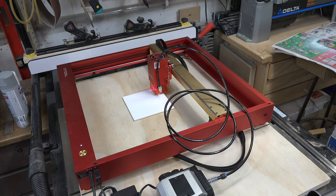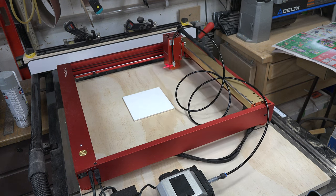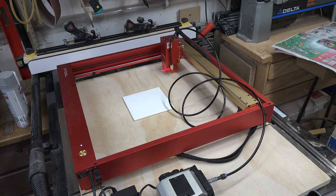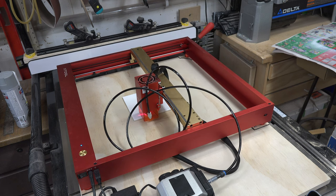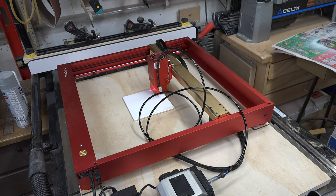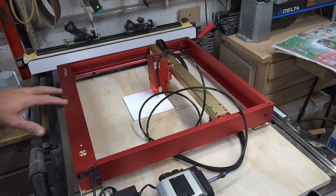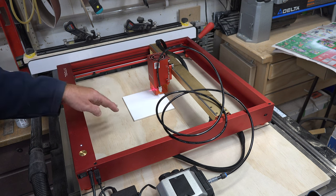The paint is dry on the tile. I've focused my laser using the drop-down focusing arm, and I'm going to click it to the home position to make sure the framing is right — in other words, to make sure it's going to burn where I want it to. Then I'll press frame, and it will show me the area it's going to be engraving. That looks good to me.